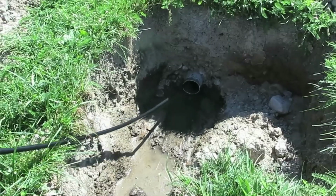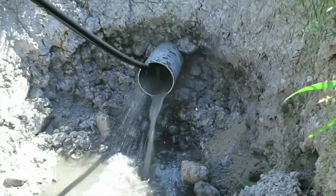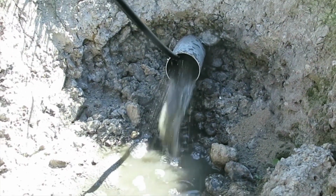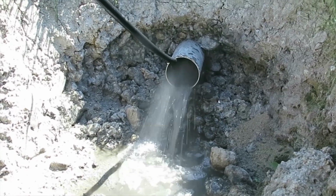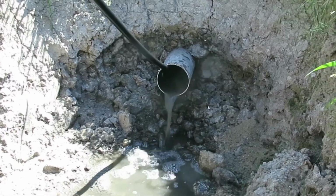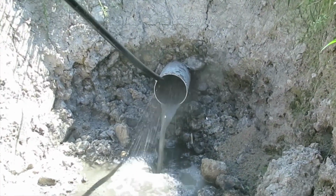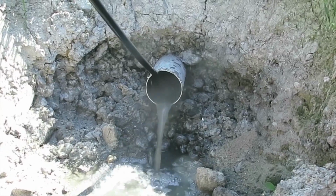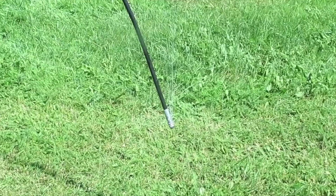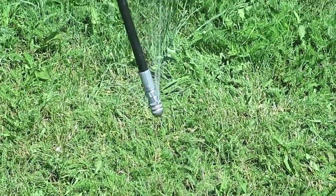Then dig down and find the ends of your leaching pipes. Cut off the ends of the pipes to open them and to allow the flexible jetting attachment to enter. The head of this attachment is self-driving in that it pulls itself into the pipe under its own power. There's no need to push the jetting hose. Rather, you'll actually need to hold it back because one jet points forward to bust through the crud, while 3 jets angle backward to propel the rest of the hose inside the pipe via the force of the pressurized water. The results work very well.